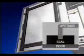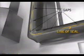Let's now take a look at the seal, which from a safety point of view is one of the most important features. This is a variant of the labyrinth or knife-edge seal. It is fixed to the inner perimeter of the door, into which the upstand of the carcass mates when closed. On the earlier prototypes, the seal was on the upstand. However, this proved to be ineffective as the seal had a tendency to crease at the corners and the likelihood of water ingress was heightened. Also, if the door was fastened incorrectly and wasn't flush, it was impossible to tell whether the seal was being compressed all the way around.